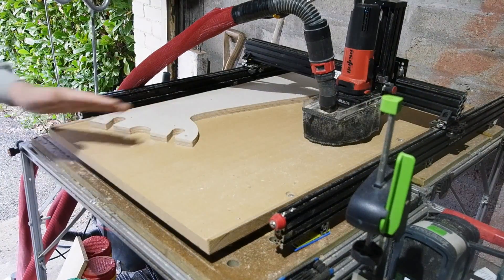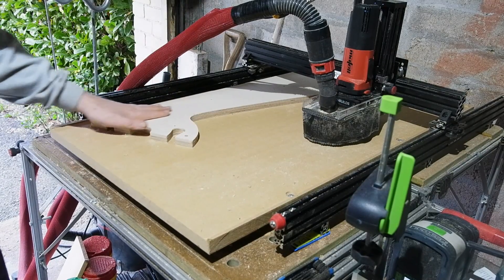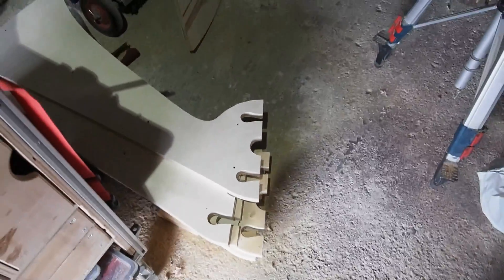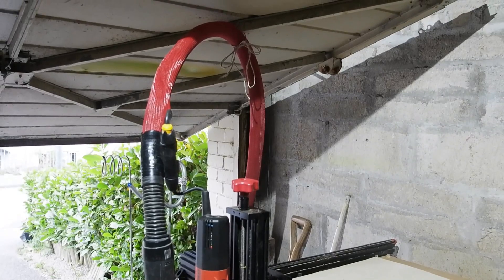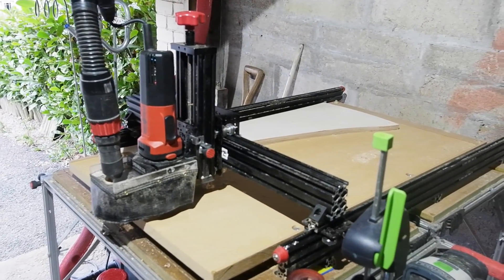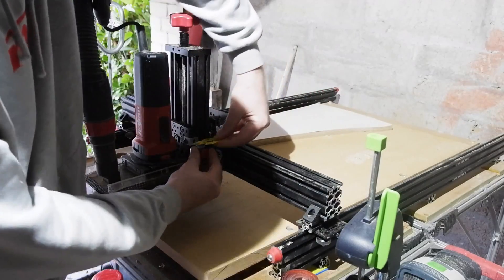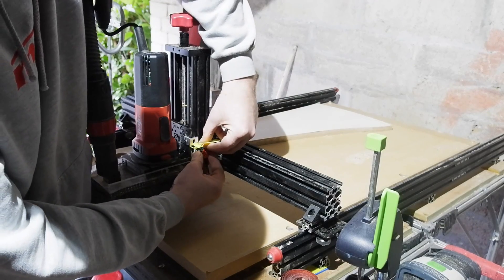So here's the task in hand. They're pieces for a tread build-up on a plywood spiral staircase we're working on. Given the inconsistencies in the material, overshoot from first floor height means taking 2mm off one piece in each tread — 17 pieces like this to do in all. As face sides of each piece are hidden in a stack, I just pre-drill and screw each piece to the spoil board for machining. I zeroed the bit on a work piece then used a 1mm packer to set the depth stop for each pass.